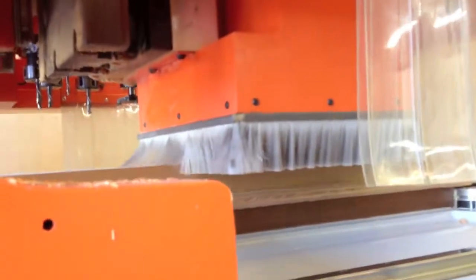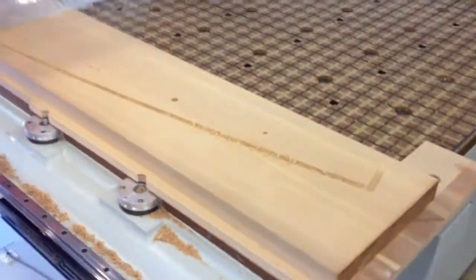Then we came up with the idea of registering each part on top of each other with an 8mm dowel. That's an 8mm bit in the drill bank going all the way through. So you've got the 8mm holes and the 9/16-inch through-holes for the all-thread, and then we start outlining the part.